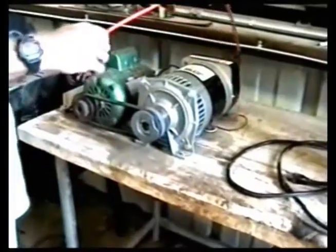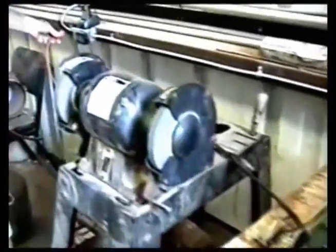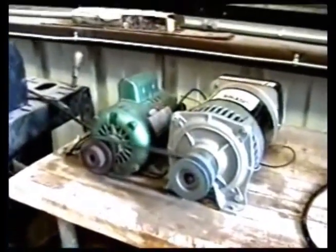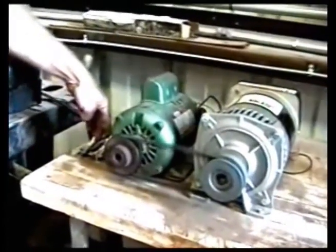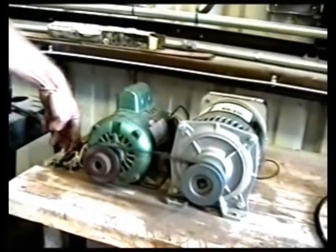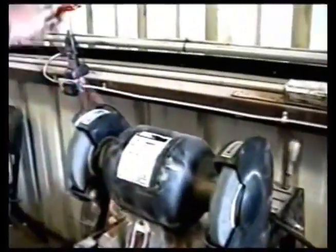What we're going to do right now is take this AC extension and plug it into the power source, turn on the unit, switch over the unit to the generator source itself, then unplug from the AC and simply lay that over here.